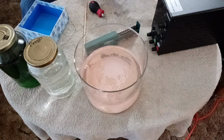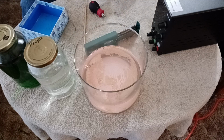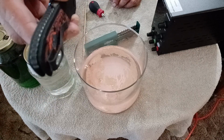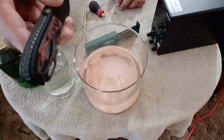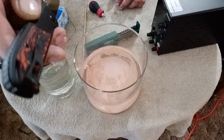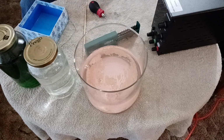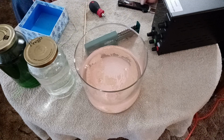All right, people. Well, that's it for today. I hope that helped out everybody, showing you how to anodize titanium to black using manganese sulfate. It's manganese, not magnesium. Manganese sulfate, and the brand is High Yield. Basically it's a fertilizer. Works really well. I haven't done a scale yet, but I've done clips and backspacers, and it works perfectly fine for that.